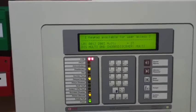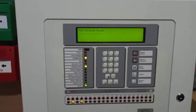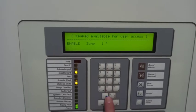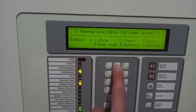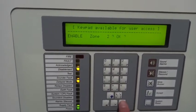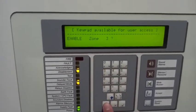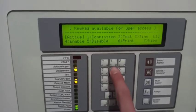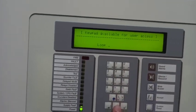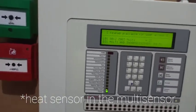Okay, we're good to go. I'll take it out of delayed day mode for testing the heat detector. I'll re-enable the zones. One thing I don't like about the Morley is that you can't just re-enable every zone that you've disabled unlike other panels. I'll go into the analog reading menu because heat takes a very long time to activate.